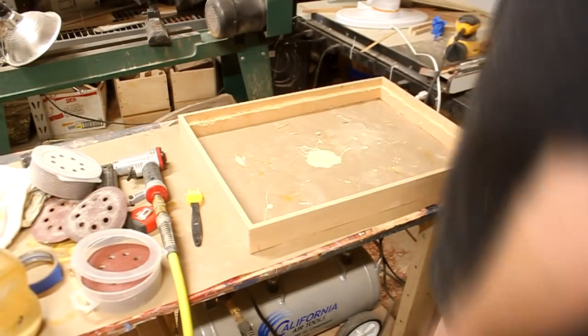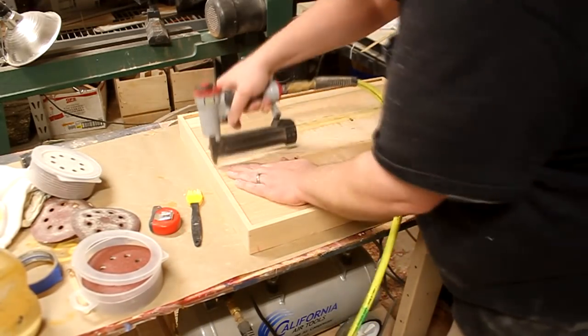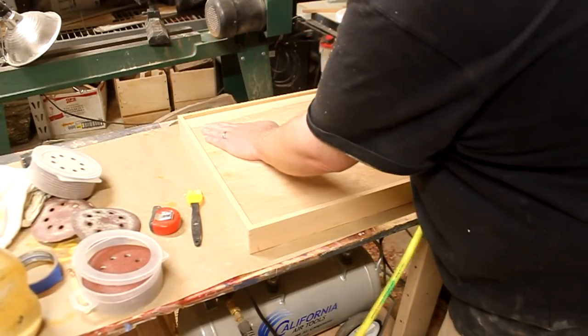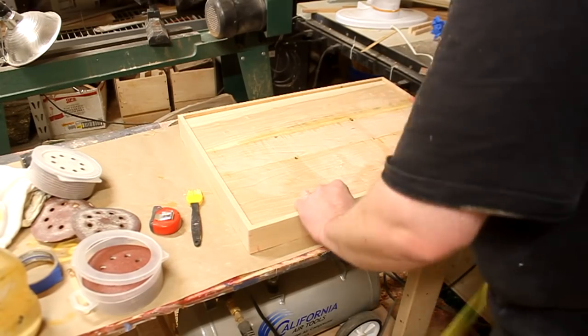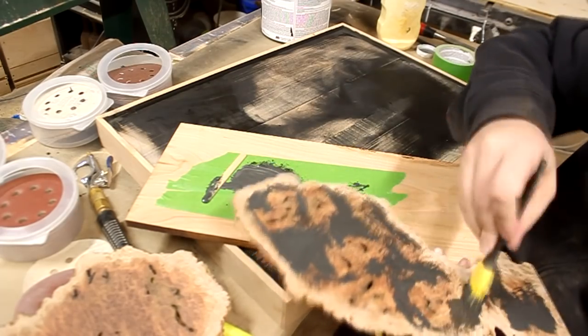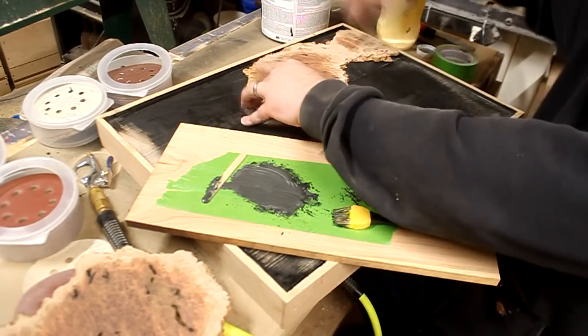This is the top and this panel is real thin - I think I got it down to a quarter inch, and I am gluing it and nailing it in place. The resin is going to be on top of this so any expansion and contraction in the wood I really want to limit. So I made the board thin and I glued it and I nailed it because this resin is going to be sitting on top of it.